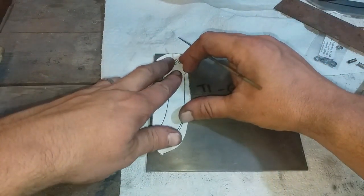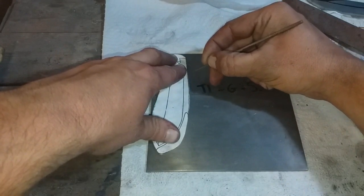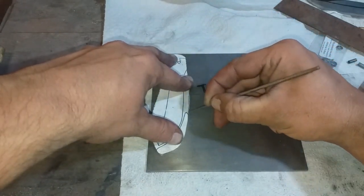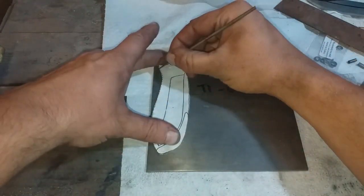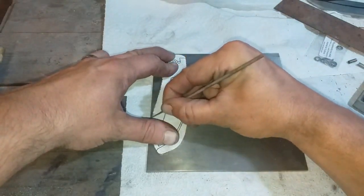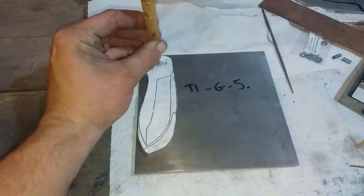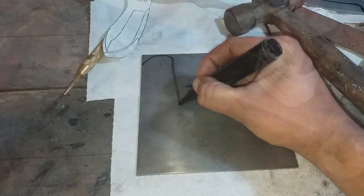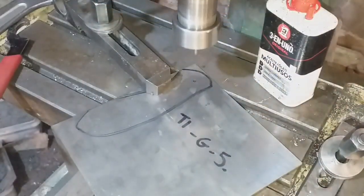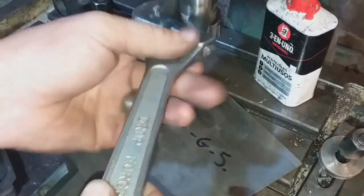I then turned my attention to creating the liner for the show side of the knife. For this, I used a piece of 2mm thick grade 5 titanium. I went through the stages again of drilling and then reaming out the area for the pivot pin.